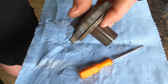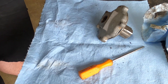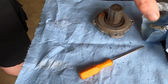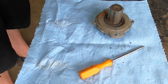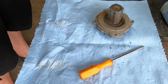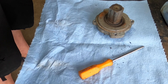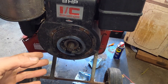I'm going to press this on a bit more with the vise to close that gap, then get it installed. I already cleaned the shaft — that's where a lot of this dirt came from. You can put a little bit of oil on the shafts before you install it. You want very minimal oil — something lightweight like zero-W20 motor oil is probably borderline too thick. ATF is really good. Just put maybe a drop on there. If you put too much, dirt will get in and cause the problem we were having. These are meant to run mostly dry — definitely do not put grease.